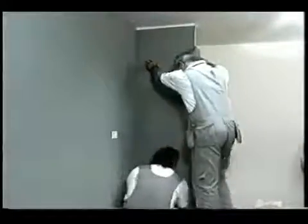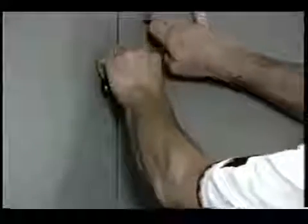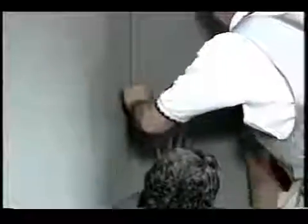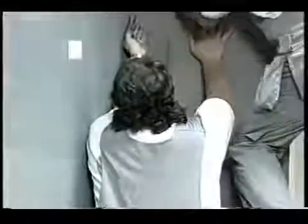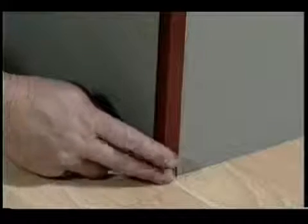Your installation may include an inside or outside corner. For inside corners, you'll want to use a method called undercutting. This is done to eliminate any binding of two square cut edges fighting to get into the corner. When cutting your piece, simply angle the knife away from the scribe line, but do not allow the blade to deviate from it while cutting. Finish outside edges using corner guard molding. However, you'll want to use either solid color, plastic, or wood corner molding to hide the edges.